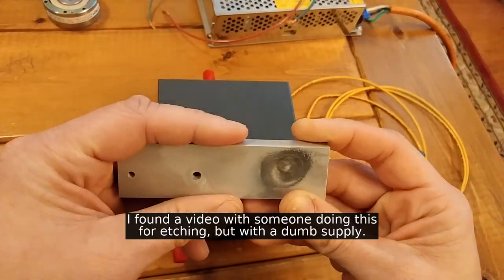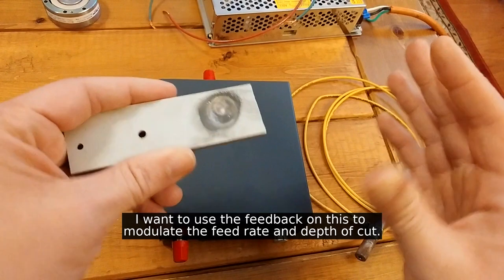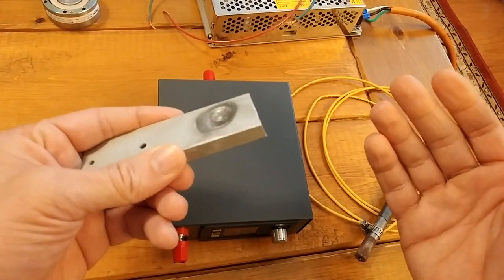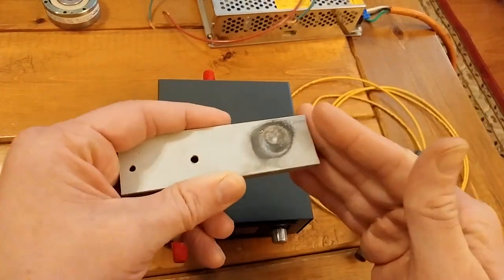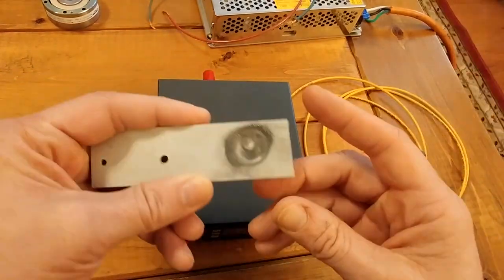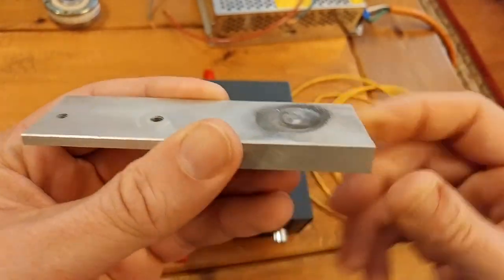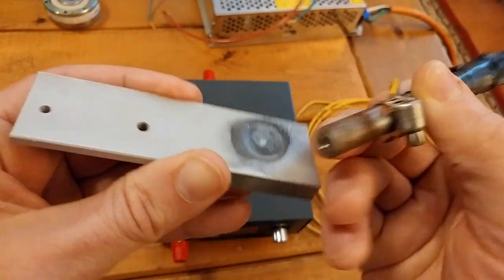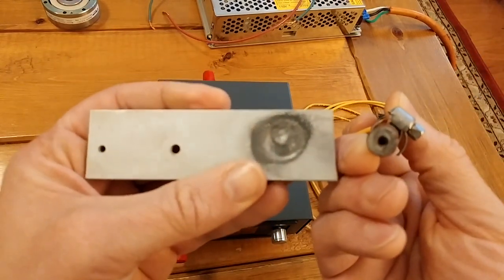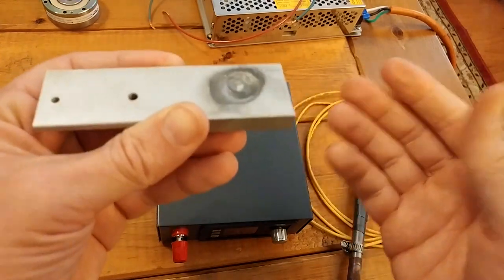My thought is I can put this on a 3D printer and turn that into a kind of makeshift mill. I imagine I could probably get one to two cubic inches per hour — maybe even up to three — and yeah, that's not a fast material removal rate, but we're talking about machining metal on a 3D printer. Usually a 3D printer takes like four hours to make a plastic part; if it takes four hours to make a metal part, that's already a pretty good improvement. Also, there's a little bump in the middle of the test divot that came from a center drill mark on the electrode — it transferred right there, which shows there's some real possibility for intricate cuts.